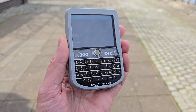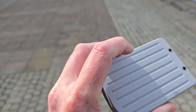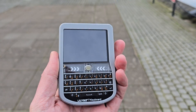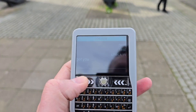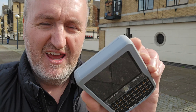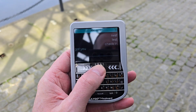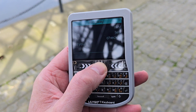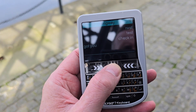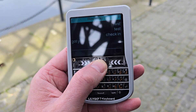I like this device. I've got a 2Ah battery in this with two 1000mAh cells, kind of paralleled together in the back, so you can still retain the slim form factor but it has quite a decent capacity. I'm still walking — I might send another message in a minute just to check in. You'll notice this one doesn't have an SMA antenna — I've just got one of the original helical antennas that came with the original Heltec, the short curly ones, and it actually works really well. Another thing you'll notice about the display is it isn't that readable in bright sunlight, but what I do like with this firmware is the text is quite big. Initially I thought it looked a bit like a child's toy, but I can see why it's been done that way — so you can actually see it a lot clearer.